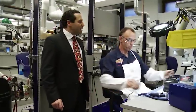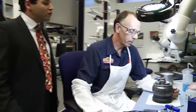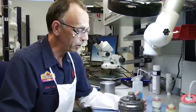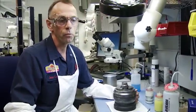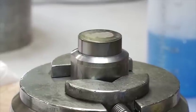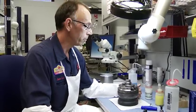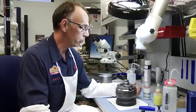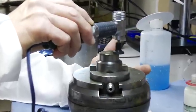We're at the next stage of die production with Jean-Luc, who is working on die polishing. A die received from the furnace is polished depending on what the engraver wishes to appear. In this case, being a proof die, the queen, the letters, and the flat are all frosted with laser, so the field must be polished to a mirror finish — no scratches, no pits, nothing. When you see that brilliant shine on Royal Canadian Mint coins, this is one of the key steps along the way.